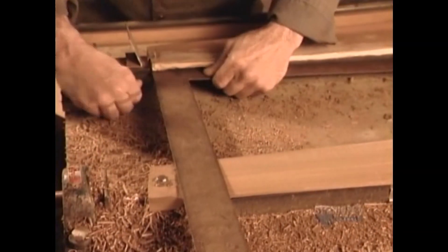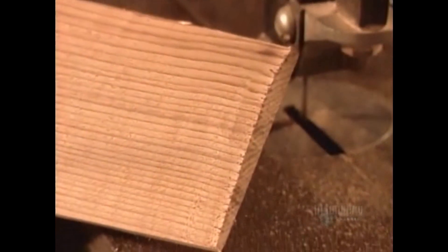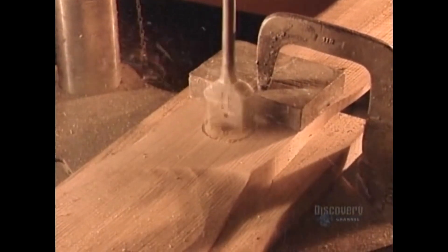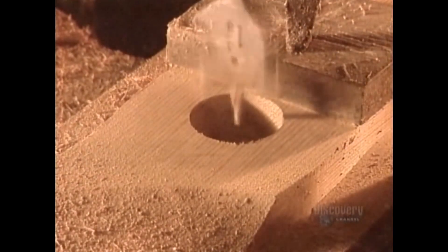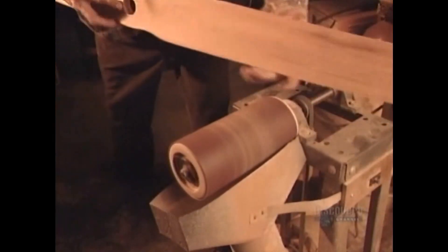You can see the profile well once they've marked and cut off the excess on the ends. One side is flat, while the other is curved like an airplane's wing. Now they widen the hole in the middle of the propeller and sand off the ridges left by the carving, using a low pressure inflatable drum sander, the only type flexible enough to really get into the curves.